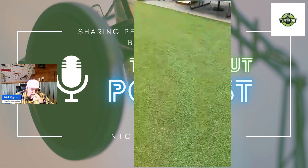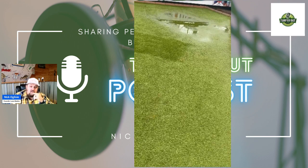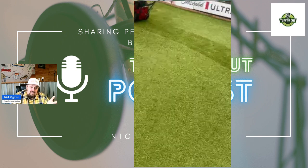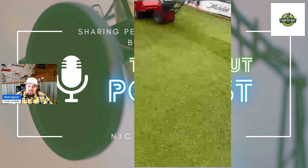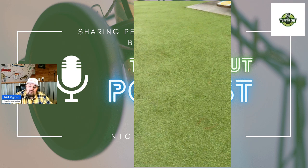So I noticed that they had another area over there where they have tables and stuff where they sit at. But look at this, all that water standing. Now the base, the job was done good, but what's happened is stuff has gotten in this turf, and so it slows down the drainage. So I took the broom, made one pass, showed the guy the difference, and immediately he said, "Yes, I want you to do the whole entire thing." Because seeing is believing whenever you go to a project like this, right? So he could see the difference. And now I'm gonna show you what happens afterwards, the difference.